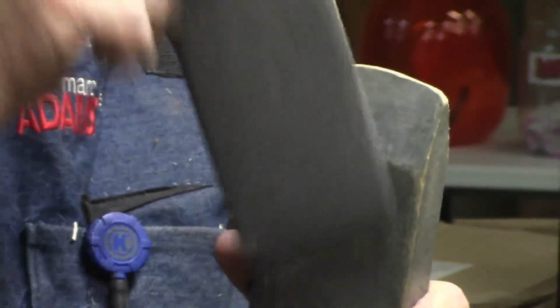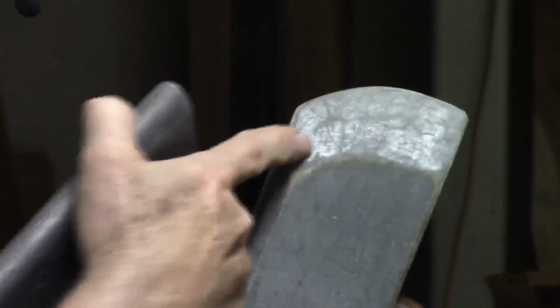So what you do, you always start on the back. You're not doing anything. Oh, yes, you are. You know what? The last thing the wood sees is the back of the bevel. Woodturners meet this when they hollow and it cuts the wood. You don't know what did that. It wasn't the edge. It's the back of the bevel. Same with the skew. I want to soften this. So believe it or not, the setup is you're softening the back of the bevel.